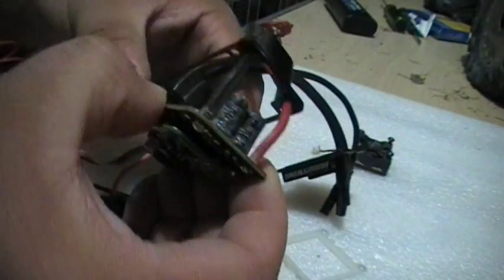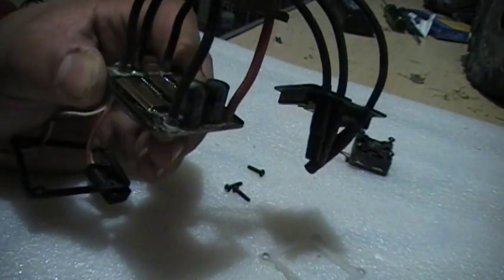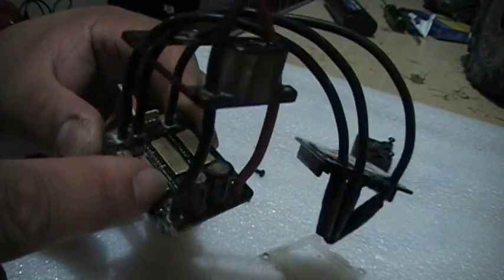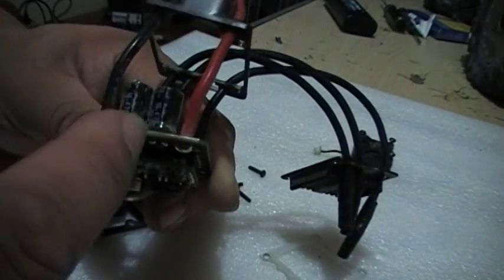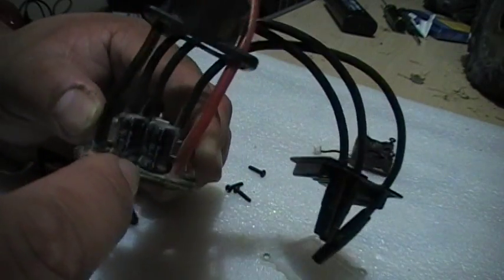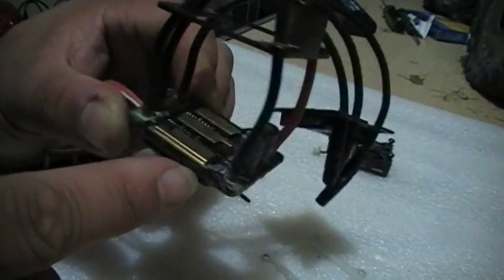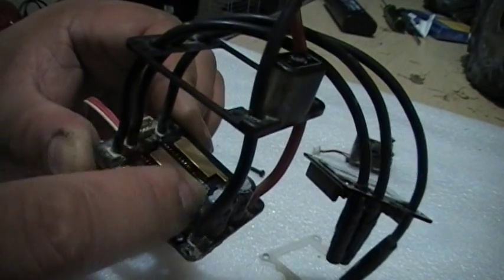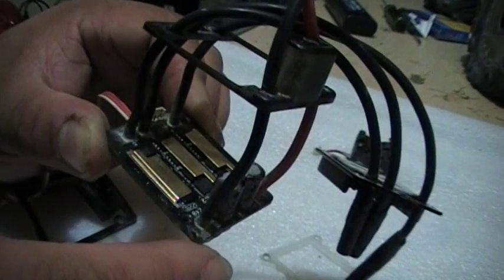You have to kind of slowly pry it up because of the wiring — you don't actually have to desolder anything on this. But the problem was that little gasket would seal the heat sink and the MOSFETs, but water would get in here into the caps and seep in underneath the other gasket, getting the MOSFETs slightly wet. That's when the truck would shut off into safety mode.